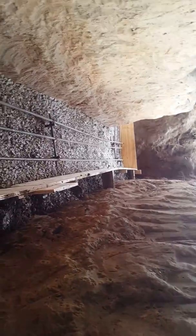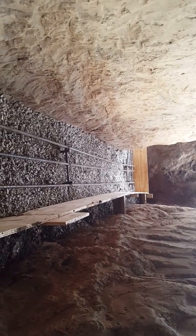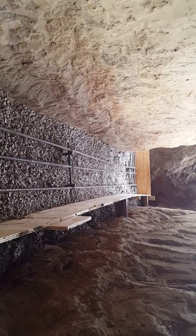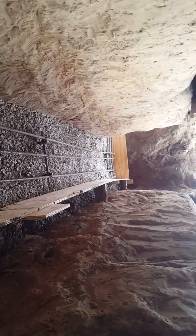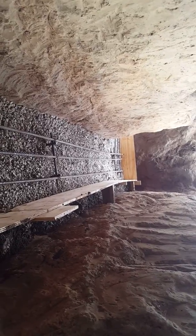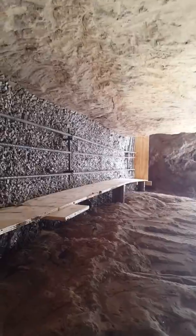So normally you want your form straight. I lost, this happens, I lost my angle grinder, and I can't afford to go buy another one in the middle of a pandemic. So I just diverted my form so that it was more than 1.5 inches away from that piece of rebar on the end. It'll just mean that the corner of the house is a little bit stronger. Tends to be where things fail anyway. A lot of load on houses rests on the exterior.